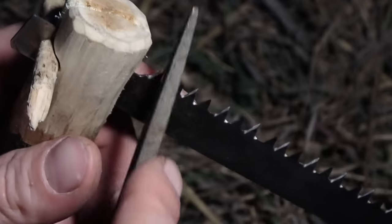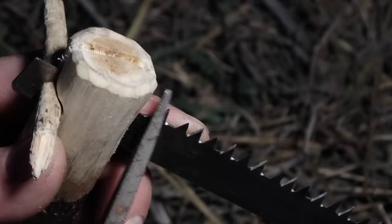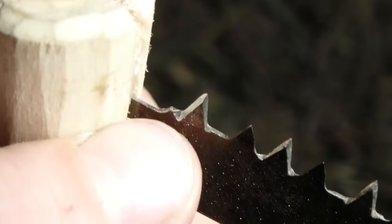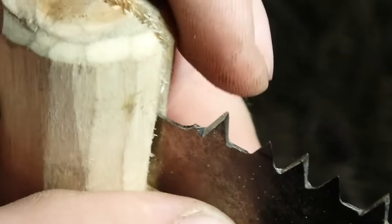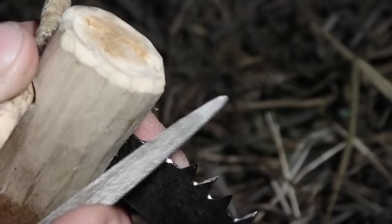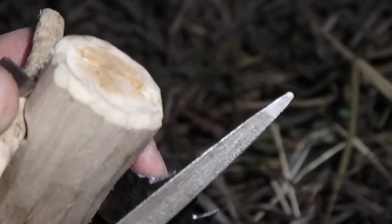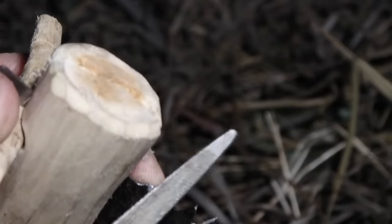You want to make sure that you're sharpening not just at the tip but the entire edge of the tooth. I'm working on an upward angle, starting at the base of the tooth and then pushing my file up to make sure I get the entire bevel. You can see this left side of the tooth we've refiled — got a nice clean bevel on it now. On the right we still have to touch that side up. Once we do, we're going to end up with a real sharp point and a good clean cutting edge on both sides of this tooth. As you do this, make sure as you come up you're not letting your file slide over the top of the tooth or else you'll round it off. And obviously you don't want to be chattering your file over top of other teeth. Just nice slight pressure, control the file, maintain your angle, and focus on sharpening one side of the tooth at a time.